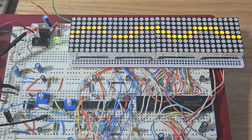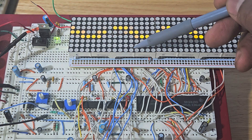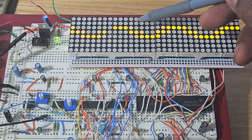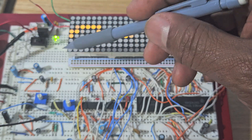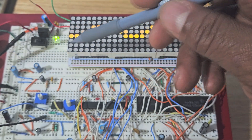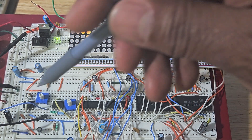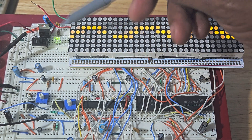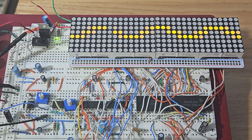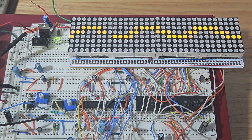On the analog end I have comparators — eight of them, one for each stage, one through eight, so you got eight levels. When you put your voltage in from the wave, it'll be a sine wave going up and down, so your comparators go up and down. This is where you get your voltage peak of the waveform. Hopefully I'm explaining that right. That's pretty much it.